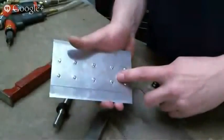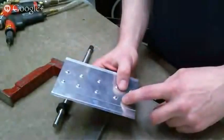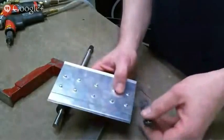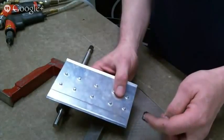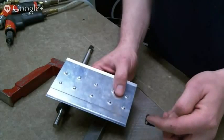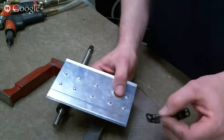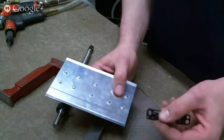So then this piece that I found in my toolbox from the air show has some rivets that have been set. And again, in this corner, it's labeled 3. So this hole is 1.5 times the 3/32 diameter rivet hole. And then in the corner here, there's a notch that's half the original diameter.